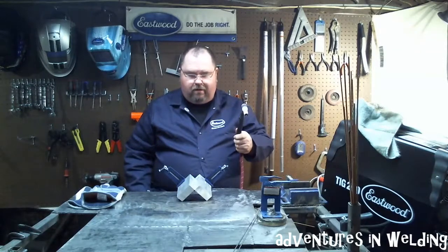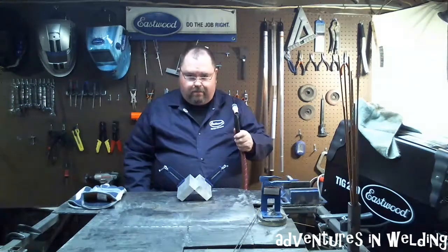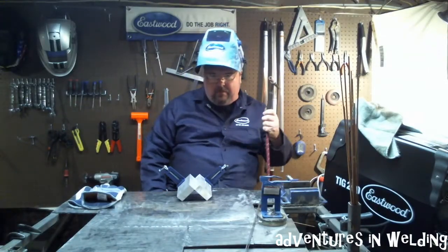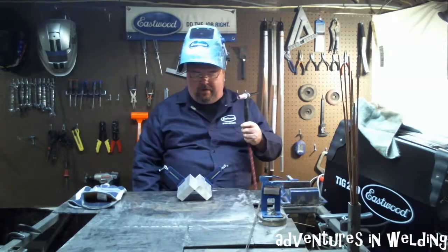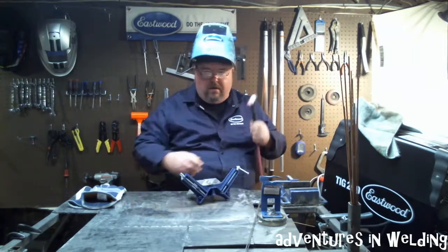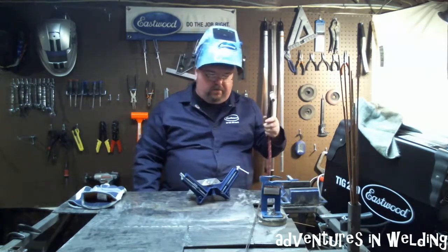So I'm gonna get started. We're gonna tack it, and then we're gonna nail it. Let's see how it goes. Turn your gas on, turn your machine on, step on the pedal, purge the line, make sure you're getting argon. There aren't going to be any arc shots for the tack up, but there will be arc shots for the weld.